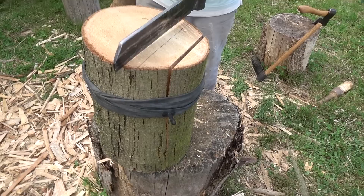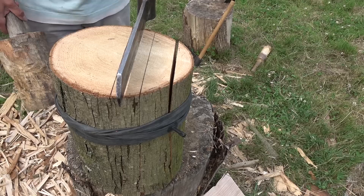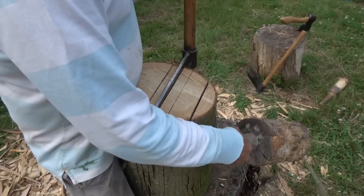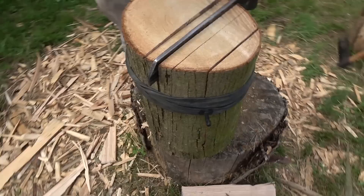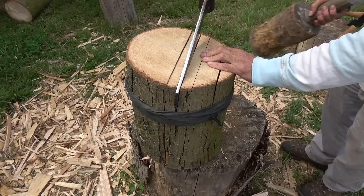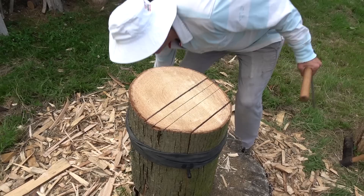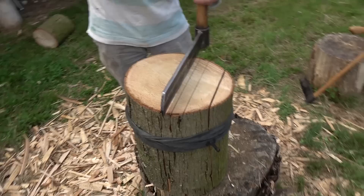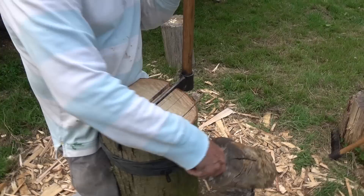Now we take this half. It may taper a bit, but not too bad. You've got to take a view here — can I get four out of that? It's a bit chunky for two, ideally a little bit bigger. This is a more difficult log — it's not splitting open, so we're having to knock the fro out and use the other fro to split it at the end. So about 16 shingles. Actually slightly differently because there are two centre ones — those you want to take in half because they're too close to the pith of the wood. So 24, or something like that.